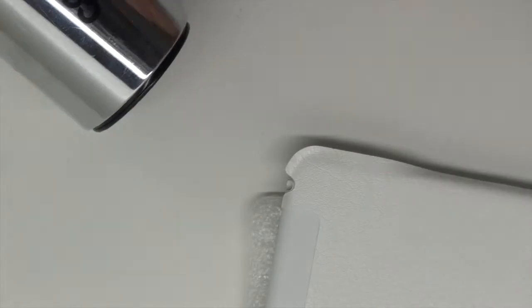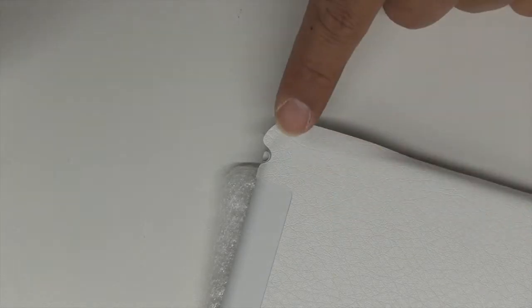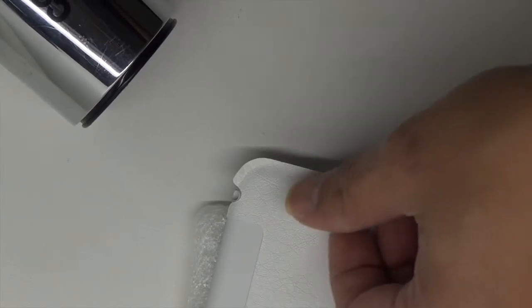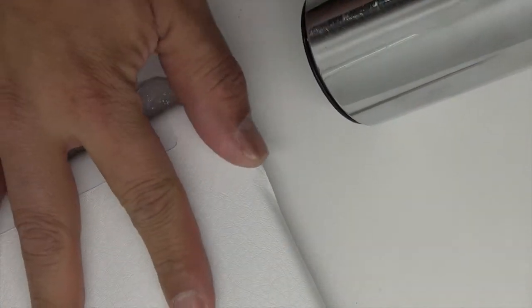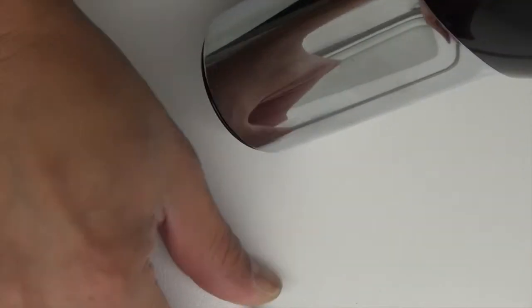And this one's just as simple as the bottom. But a nice little tip and trick, you want to keep at least 3 finger lengths away from the edge, so this area here will retract during the heating process. So we're going to continue on with heating this corner, and you're going to see that that elongated area is retracting as we heat it and then press down. It leaves for a minimal amount of pressure to be pressed down on that elongated side.